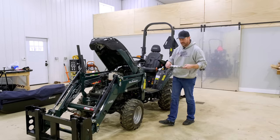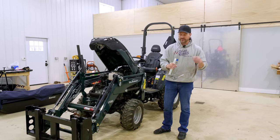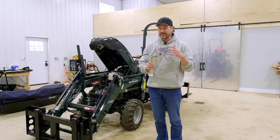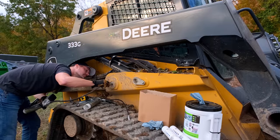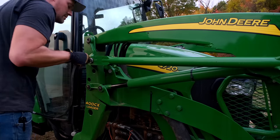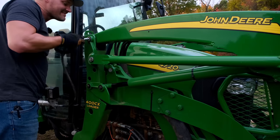You can see how easy it is just to take it apart and put it back together. If you're switching tubes, whatever else, you just push that plunger up so you have that vacuum — that's how this thing operates. When you squeeze this lever handle here, there's suction involved, just pushing the grease right on through. They do have a battery-powered electric grease gun as well — quite a bit more expensive, but a very nice option, especially if you have arthritis in your hands or have trouble squeezing the trigger over and over.